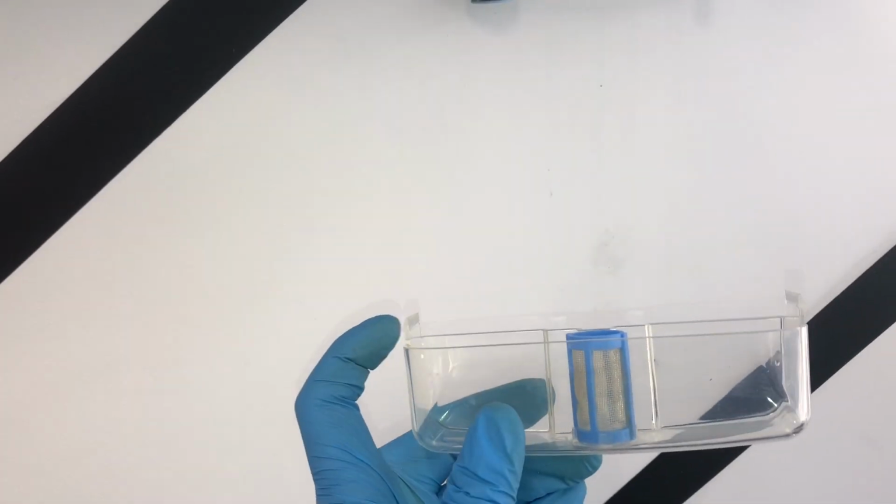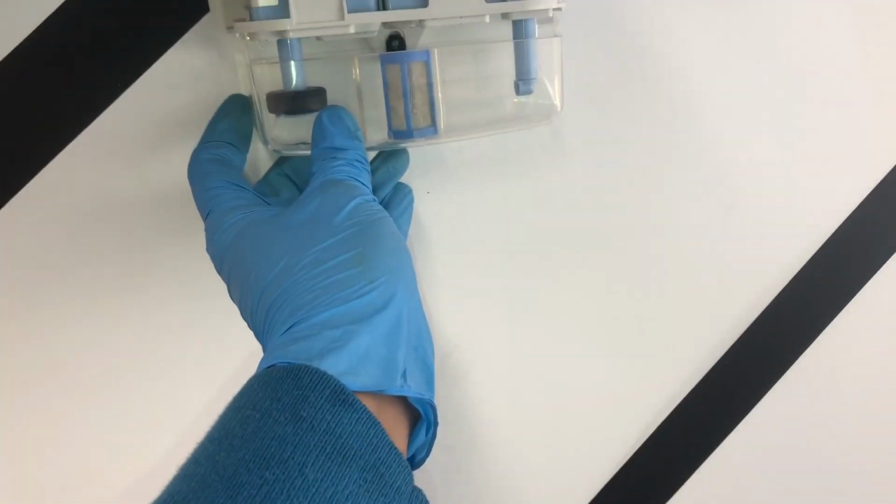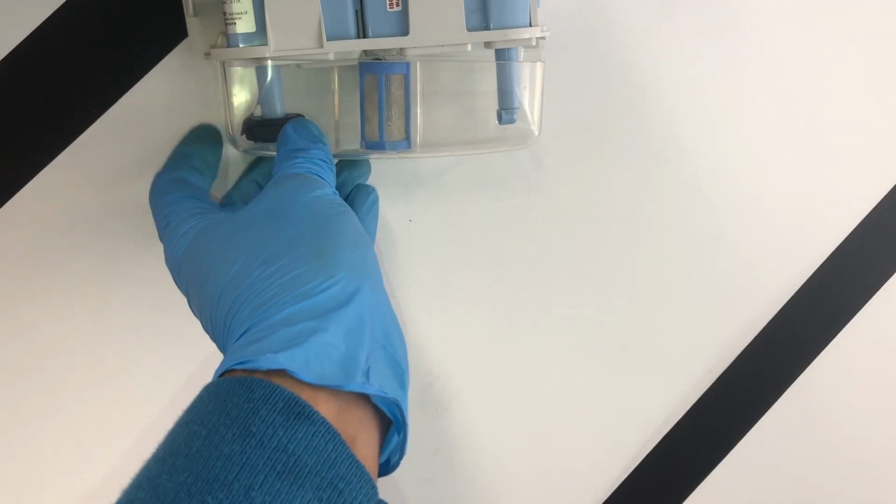Floater is our actuator for the system. There's a little bit of slime there. You see that little booger right there? That's slime. So we want to clean that out, because that confuses your machine. When your floater goes up, you see we raise it up and the pump starts working. 2 tabs on each side, and you gently just push up until you hear it click.